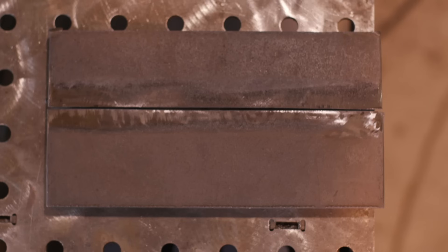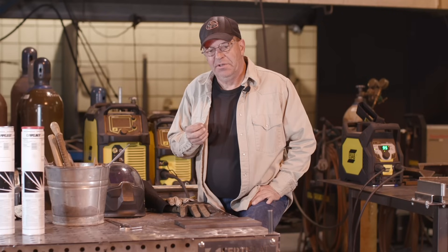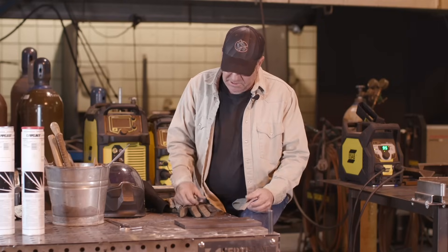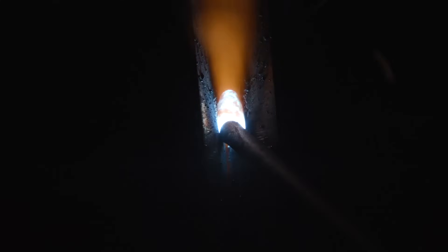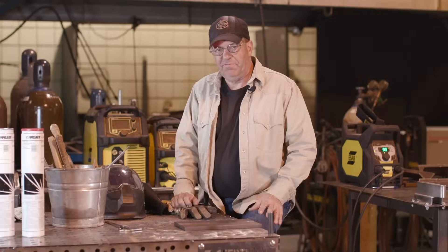This whole deal was for a downhill root pass and some fill passes. Normally when I'm running downhill, I like a pretty tight fit and run hot amperage. But this is going to create a little bit of a problem here — we're opened up in the middle and tight up on the ends. Let me get some gear on and get fit up here, and we'll show you what's going on.